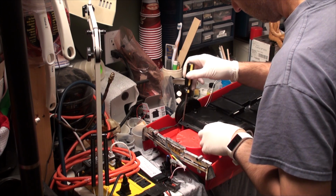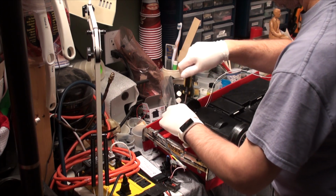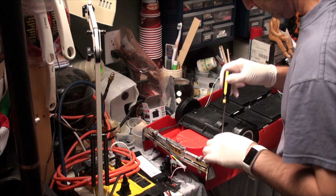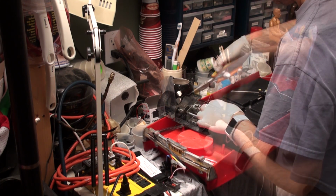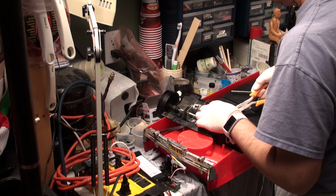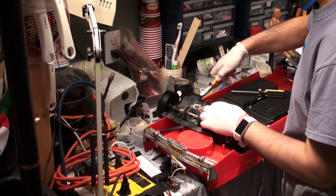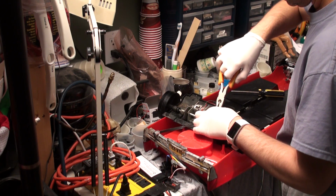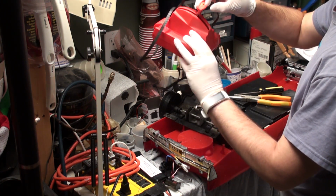Next, the rear wheel assembly has to be connected to the speed controller module. I removed the rear wheel assembly from the car, which is attached with 4 self-tapping screws. Then it was time to disconnect the control mechanism by disconnecting the wires that had been attached to the car since 1964. The wires had metal cones that connected them in a molded plastic cylinder, creating a compression connection, eliminating any need for soldering. Out with the old, in with the new.